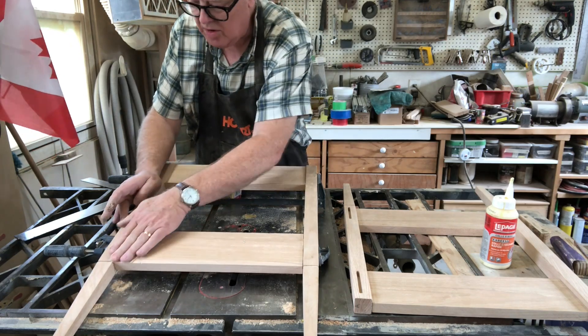I do have the table legs angled in a little bit, as you can see, so I'm just going to put a little spreader bar on the top just to get them where they need to be. Just a little more glue to squeeze out on the back, which is wonderful. That's one of our nightstands assembled. I have to put the top on of course and get the shelf mounted.